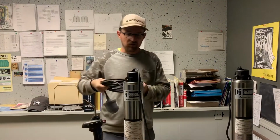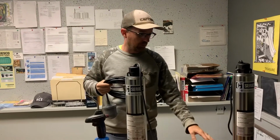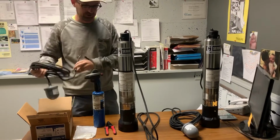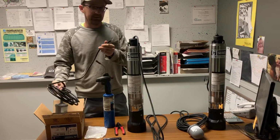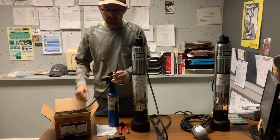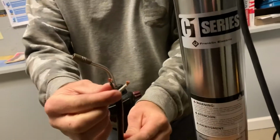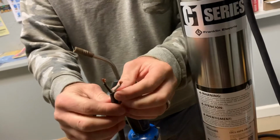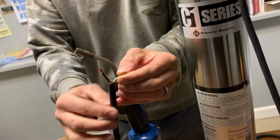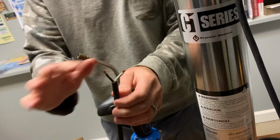With the normally open float switch, if you order a pump from us with a normally open float switch, we will pre-assemble the switch to the pump at no additional charge. But if you wanted to assemble it yourself, you'll notice that there are two wires coming out of the float switch. There's a white wire and a black wire. Ordinarily, white and black mean different things in electrical circuitry. In this case, the colors mean nothing. So pay no attention to the colors.